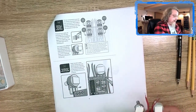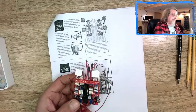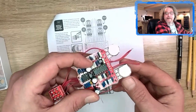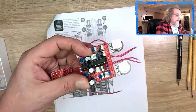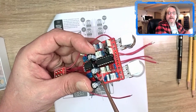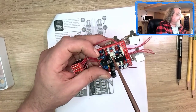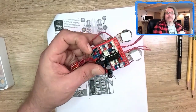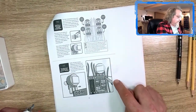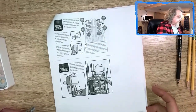And at that point, I went to put on those 3 electrolytics, the big ones that I hadn't done yet, and I suddenly realized I was right. If you look here now, you can see down in here, that's where the potentiometers are soldered, and the capacitors, this one and this one, get in the way. There's no way you can get a soldering iron in there. So I would say between steps 10 and 11, or after 11, after this, so that gets them all on.